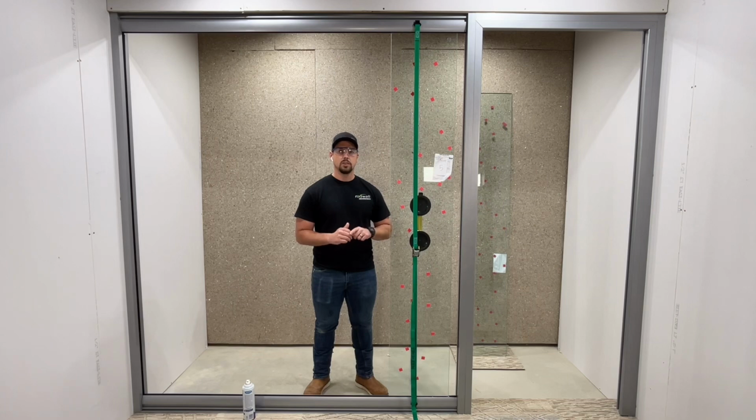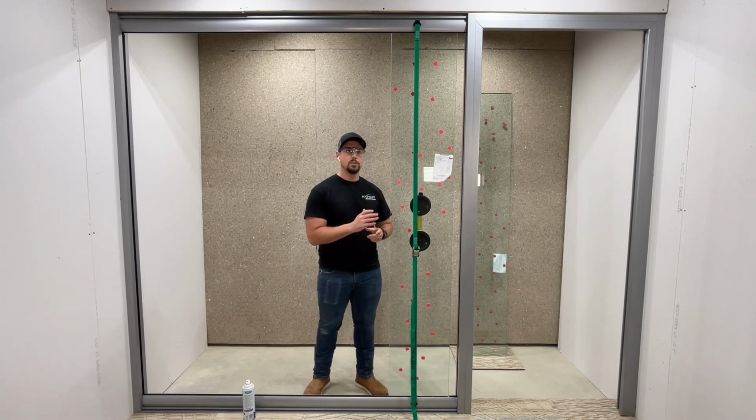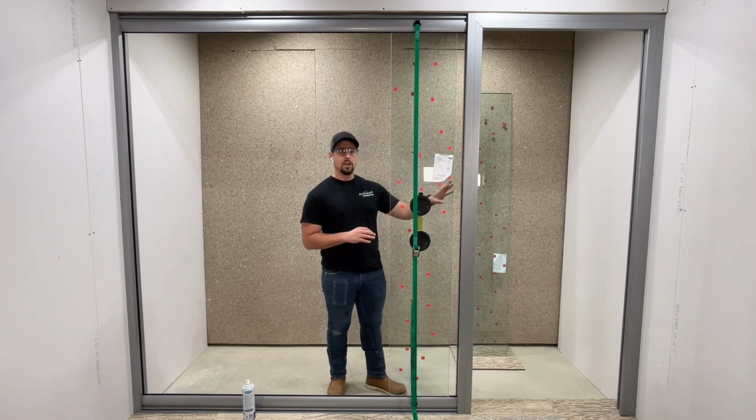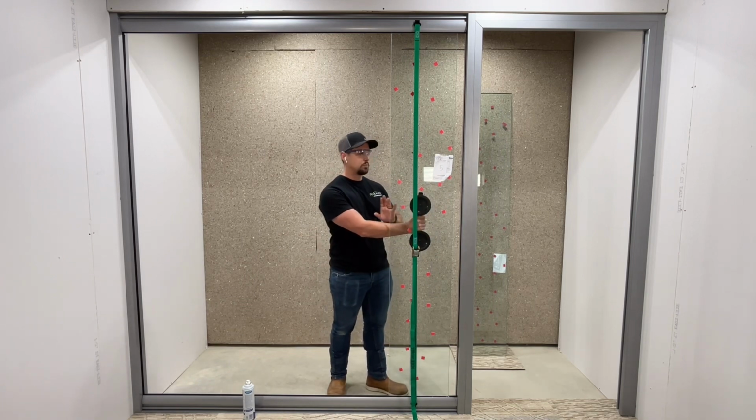Majority of glass installation situations on our view series will require a fixed pane to go into a wall start. Same as we did for the floor and the ceiling track, we'll lubricate the wall start glass channel to allow the fixed pane to slide into the wall start easily. But once you have the glass channel lubricated, all you'll need to do is push the fixed pane of glass into the wall start.